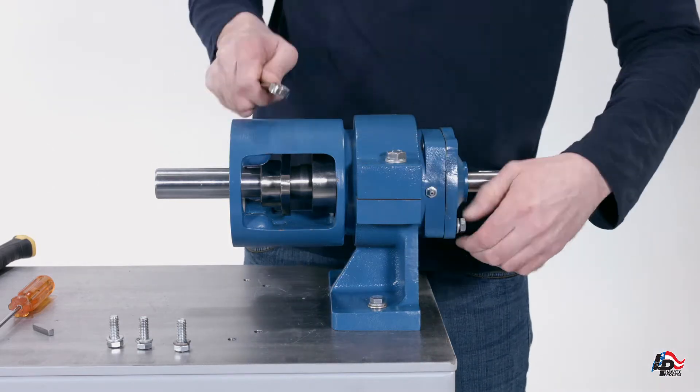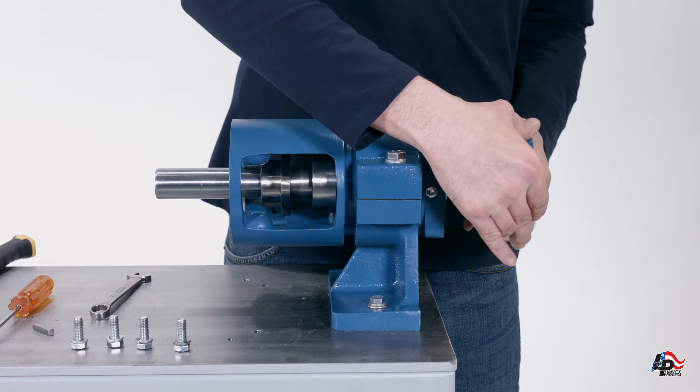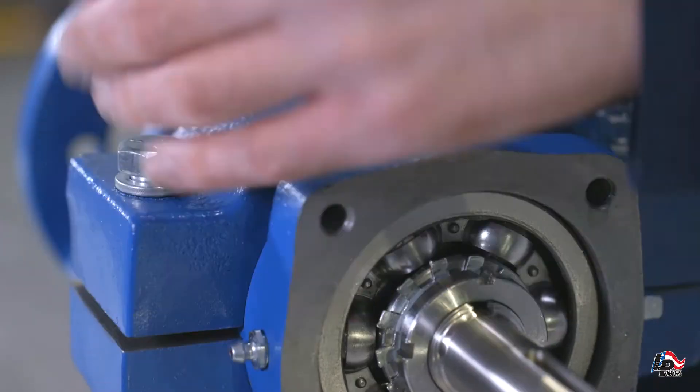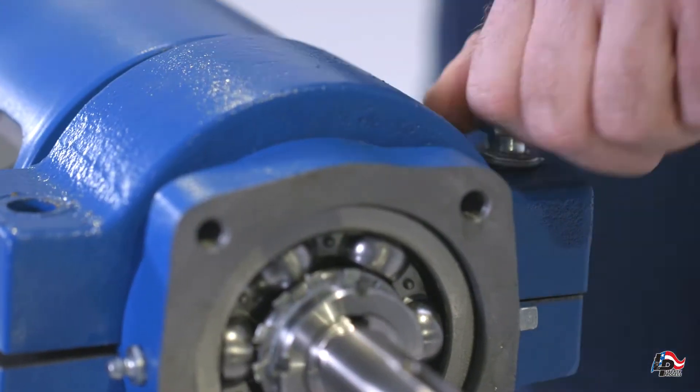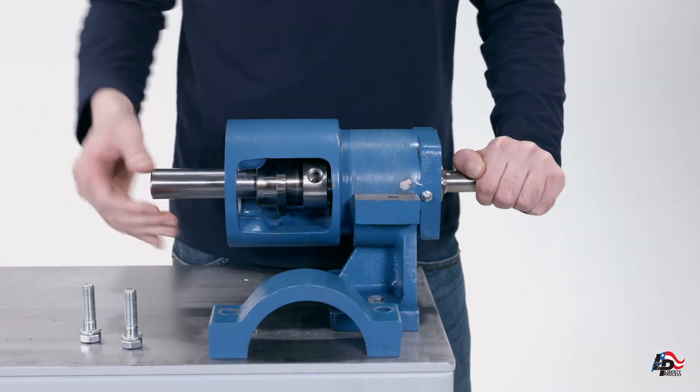You may need to tap a small wedge with a hammer to aid in removing the bearing cover plate. Take care not to damage the thrust seal installed on the cover plate. Using a three-quarter inch wrench, remove the two bolts holding the suction support cap on the bearing housing and remove the cap.